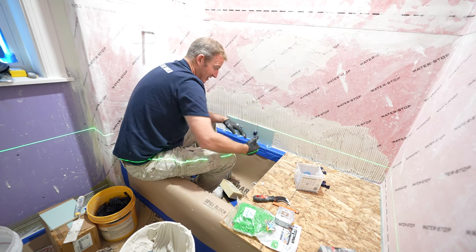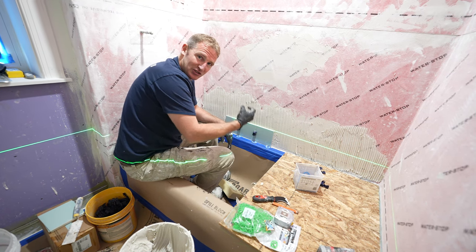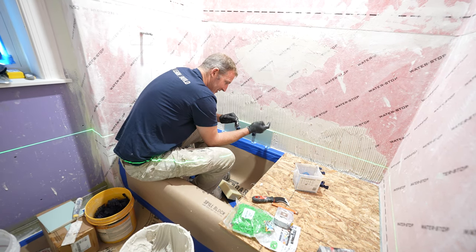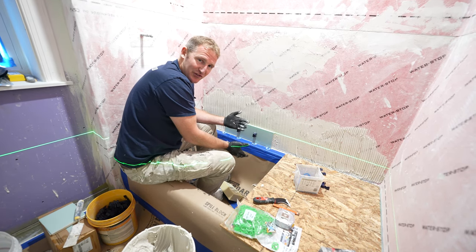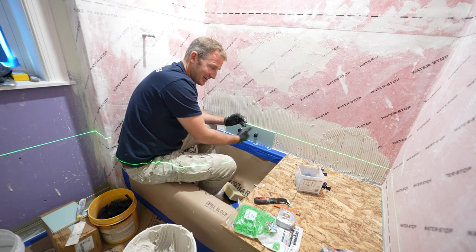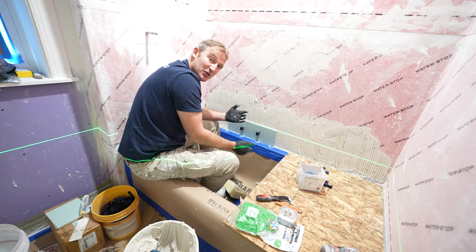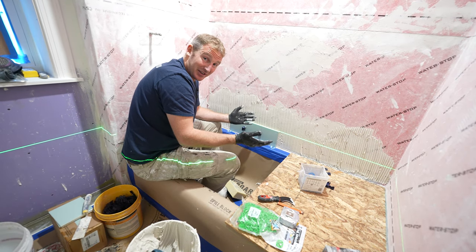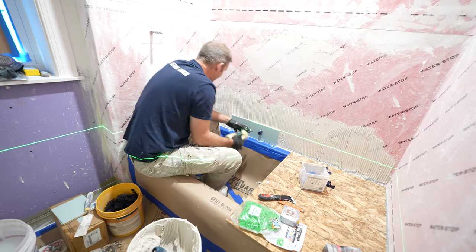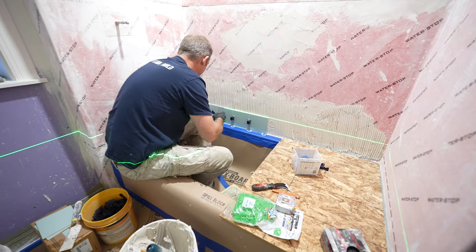But if you have a joint here, it allows the silicone to get into that joint and make a really good solid connection. If you just have the tile butted straight down on the tub deck, you're just going to smear the two surfaces. And then once you fill up that tub, it's just going to crack that joint really quickly. So if you have a gap, like a 16th, an 8th at most, it'll make that silicone joint last much longer and it's less maintenance over time. Got my clip.